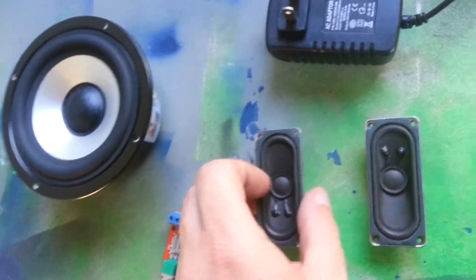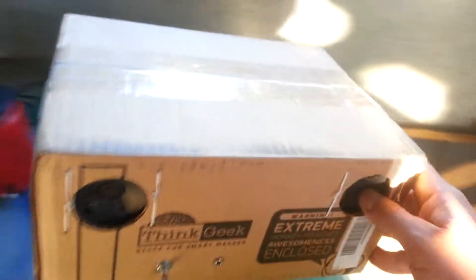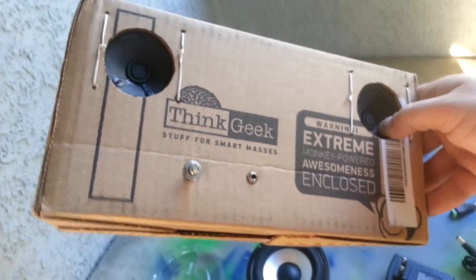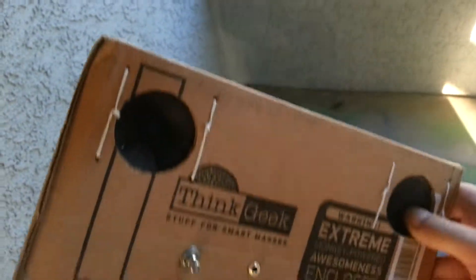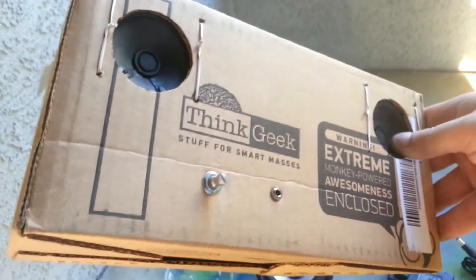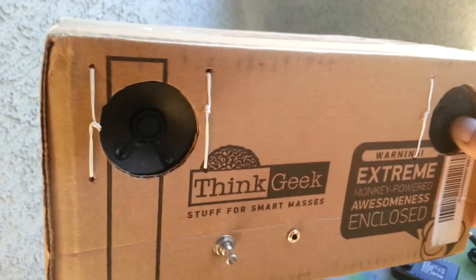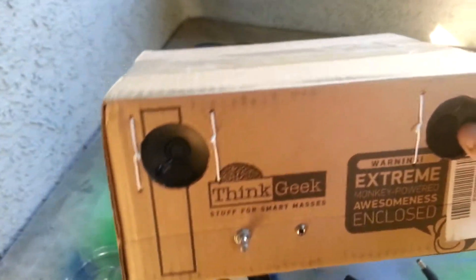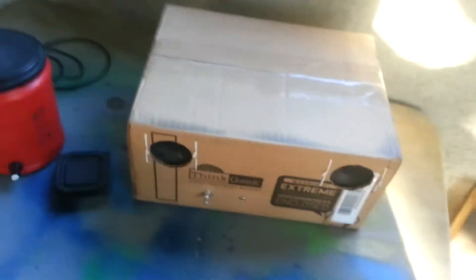So it's just going to be these things, and then what we're going to decide to put it inside is the question. My very first experiment ever was these guys right here — it's a little 5 volt version, so 5 volts. I think it's only a 6 watt output, and it can run on a little battery pack or a USB. I just wired in an audio jack that I got separately and pulled these speakers out of something else that was already broken. It was just a proof of concept — I even just wire-tied the speakers on, didn't even glue them or screw them or anything. And it sounded great — it sounded fantastic. I was really surprised at the signature that the cardboard gave it, so I really liked the cardboard.